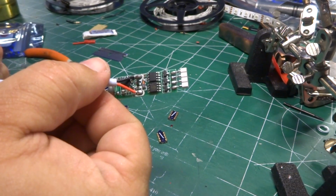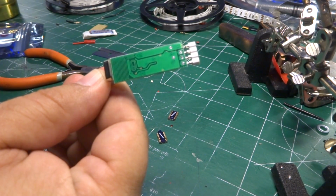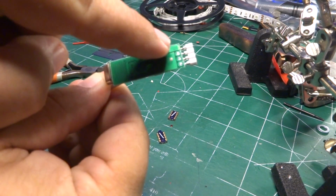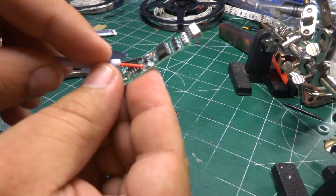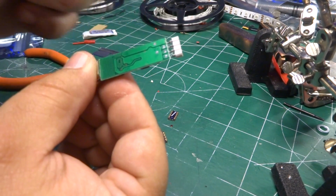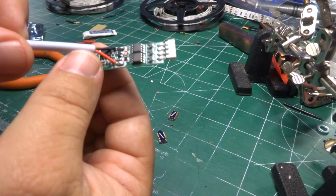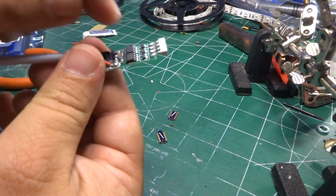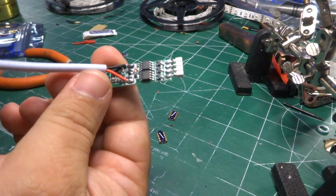And there's not really any marking on this side of the board, but you flip it over and you look at the layout of the circuit itself, you can see this. Which one of these 4, which one's different? Yeah, this one's different. It's got this big long line over here, and if you look on the other side, the flip side of that big long line, there's the positive, that's the power line, here's the power side. So of all of these, the common power connects to the common input power. And then the grounds themselves come in here, and they get modulated by these little transistors in here, and that's what the smart circuitry in here is for, and return back to ground there. Simple circuit.